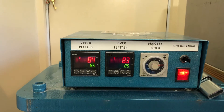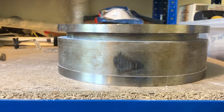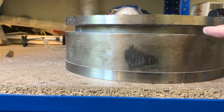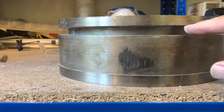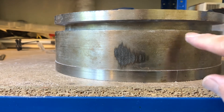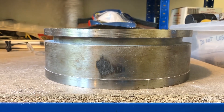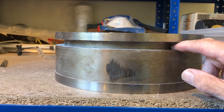Here we are — the mould can all ready to go. One of the key things about the mould can is this gap here, which is quite large at the moment. When you put it in the vulcaniser and apply pressure it's important there is still a gap of about half a centimetre. This means the top plate isn't rammed firmly down on the outer ring, because if that happens all the pressure is applied only to the metal and nothing inside, and you can get a malformed mould. The important thing is there must be a gap here.